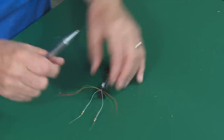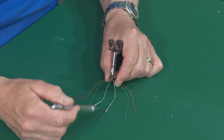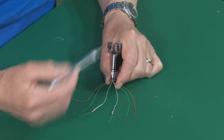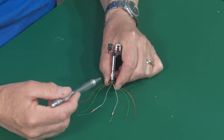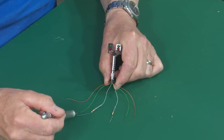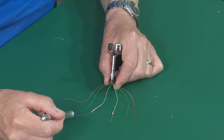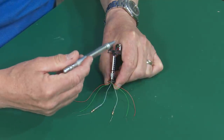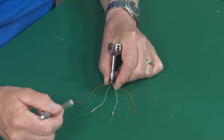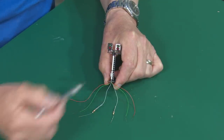Here is a TrainTech signal. Because it doesn't have any internal switching resistors, you need a resistor on the common cathode cable. This is red and green for one side, red and green for the other — used at a station platform for two lines as a starter signal. Through your switching system you decide to have a green light. Your 12 volts would be fed to the green cable post your switch, up through your LED, out through the resistor which limits the current flow since the LED can only take about three volts. Another common cathode signal.